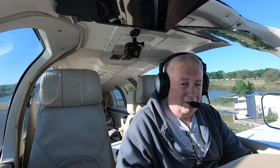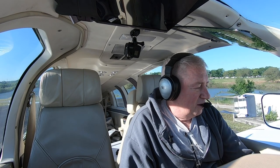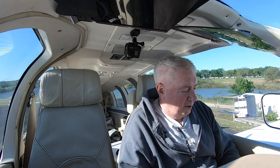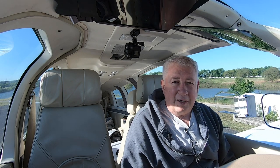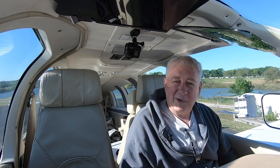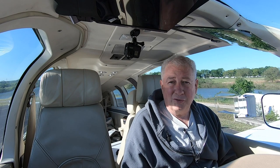I'm gonna shut it down real quick — I am where I'm gonna get gas. So that's the hot start technique for the Continental, and you gotta be really fast. But my technique is a little bit different. What I'm gonna do is prime it just like it's a cold start, and then with the throttle just where it's set, as it's starting to try to start but doesn't quite start, I'm gonna just start feeding throttle into it — increasing the air in the fuel-air mixture, trying to get that stoichiometric ratio just right. And when it happens, boom, the engine starts and off it runs. I use it all the time when it's hot.